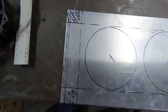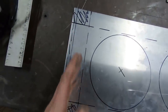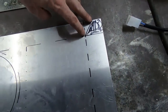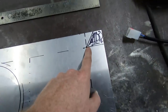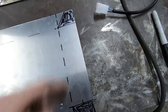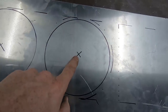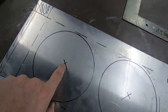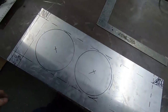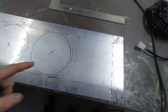All right, I just got done laying this out. All these scribbled marks are the excess that needs to get trimmed away. This end is going to be square, this end is going to have a little bit of a kick to it. I need to measure the length of this line out to here, mark the bolt holes, and the cross-centers of those are going to be the center of my fan holes. This piece of tube is darn close to the inside, so now I'll trim off the excess and trim out the holes, then fold it up.